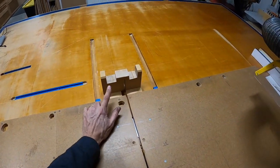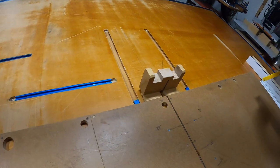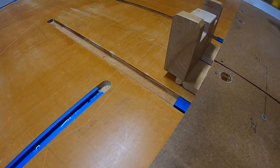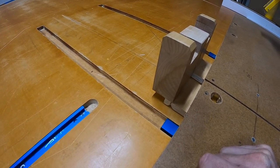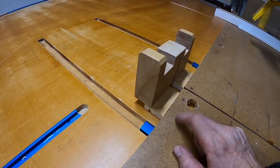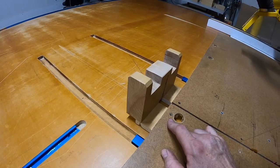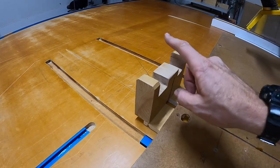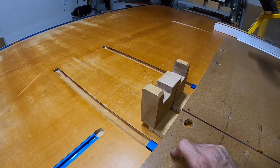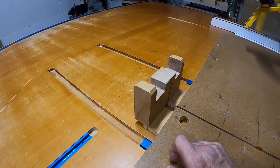I took this piece — originally it was in front just a little bit — and I moved it back. You can see on the side it's set back, which gave me about another inch more depth of cut. Now, this is one nice thing about Baltic birch: the screw holding ability is very good. The miter tracks are screwed up into this Baltic birch and it's nice to have that holding ability. There are definite pros that go with the plywood.